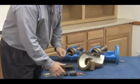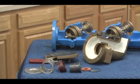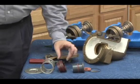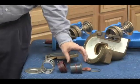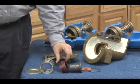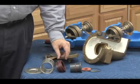Another thing that's important on this particular relief valve design, the same as back to the small ones, is the interface of the two materials. In other words, what is the relief valve guide made of, and what is the relief valve spacer made of? This is a plastic called glass-filled Noryl. Very hard plastic, very brittle, but very dimensionally stable. This stationary guide is not a plastic at all. It's actually a piece of brass that's epoxy coated.